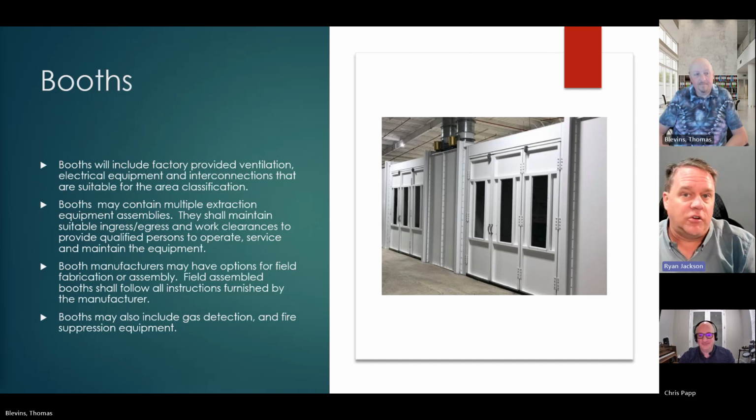If you're hazardous due to the presence of acetylene, you better have Group A rated equipment. And if you're classified due to the presence of cyclopropane, that's Group D, right? So with a spray paint booth, the risks are very similar. We've got flammable stuff, but that doesn't mean that one is necessarily good for the other. It could be, but it doesn't necessarily mean that it is. So now that there are listed extraction booths, that's what we need to be seeing. Forget the other stuff. We need it listed for that specific application.